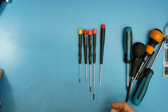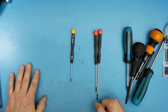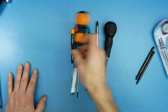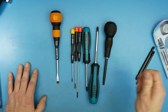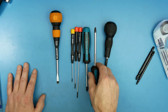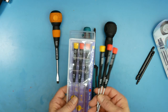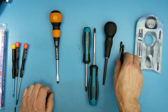I highly recommend getting a set of JIS screwdrivers no matter what, especially if you're working on electronics or Japanese motorcycles. If you're just starting out your tool collection, get these instead of an American Phillips — they will work in Phillips screws so you're getting the best of both worlds. They're extremely reasonably priced for the quality: less than ten dollars each, and the precision kit and the exchange-of-blade are both less than fifteen bucks. I'll put links in the description.